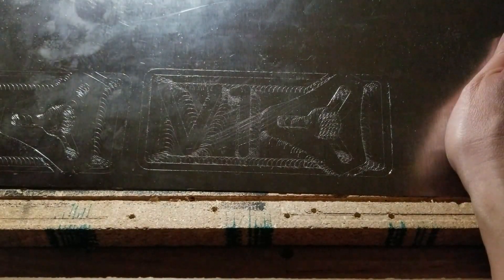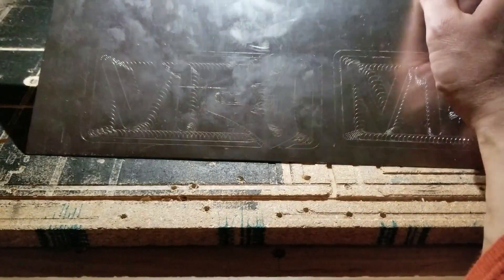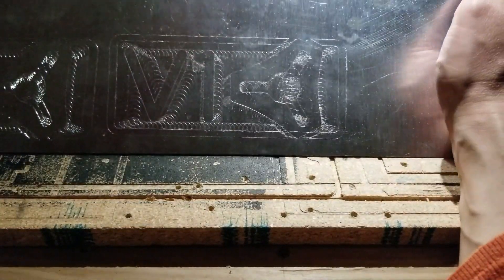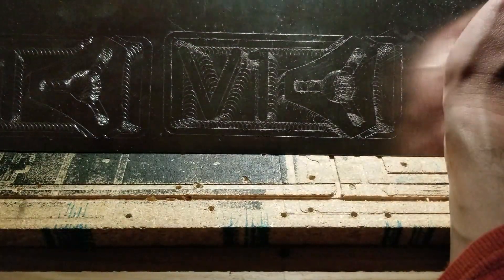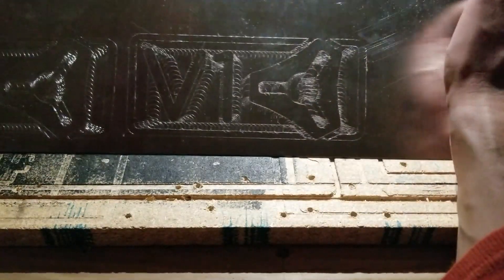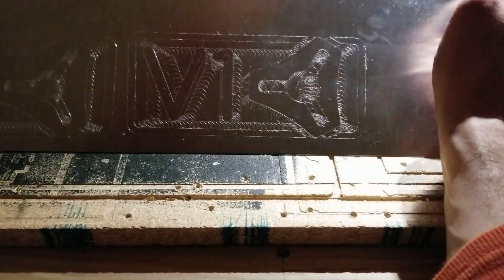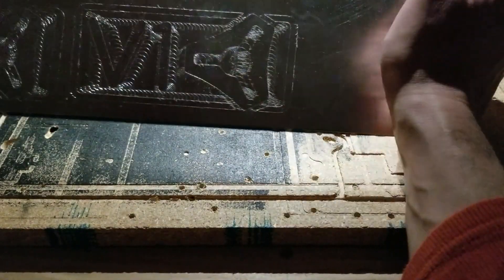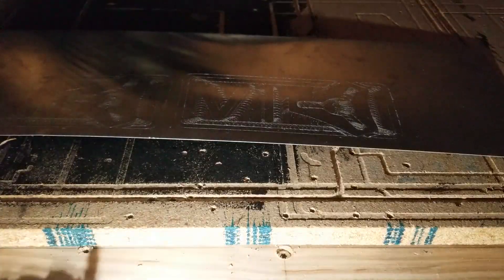I think the math is sound, but maybe the scratches are too deep, or maybe there's not enough scratches. It works — that's the one I just did. For whatever reason, this second one is more prominent. I lost some steps on the Z axis partway through the engraving, and I tried to compensate by putting some grease on there. Wow, look at that on the left — that's kind of cool. Is it better if the light is off to one side? Yeah. Partial success — that's what I'm calling this. Man, it makes me want to get a laser. Hey, if anyone wants to give me a laser, give me a laser — I'll review it and everything.